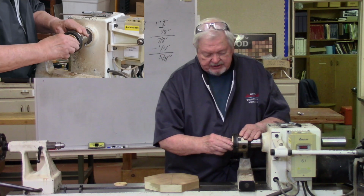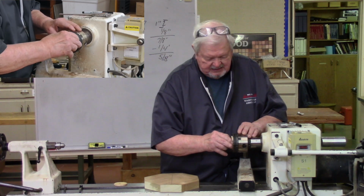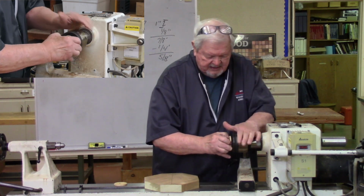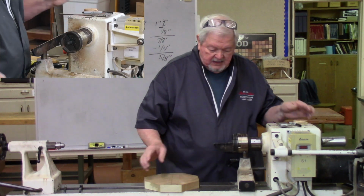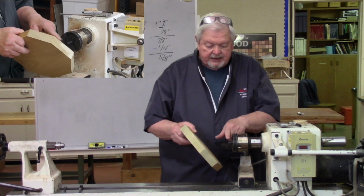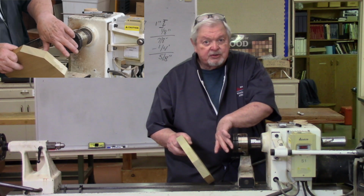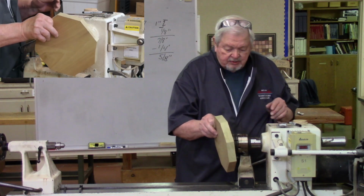So on this particular blank I'm working with now, I don't need the washers. I'm trying to get this off. But I have a series of these spacers. So what I've done is drill the hole and screw this in. I've measured to be sure that this is not too long. It must set on the top edge of these jaws. That is the reference point. The screw itself is simply to hold it back into that position. So I'm going to screw it on.